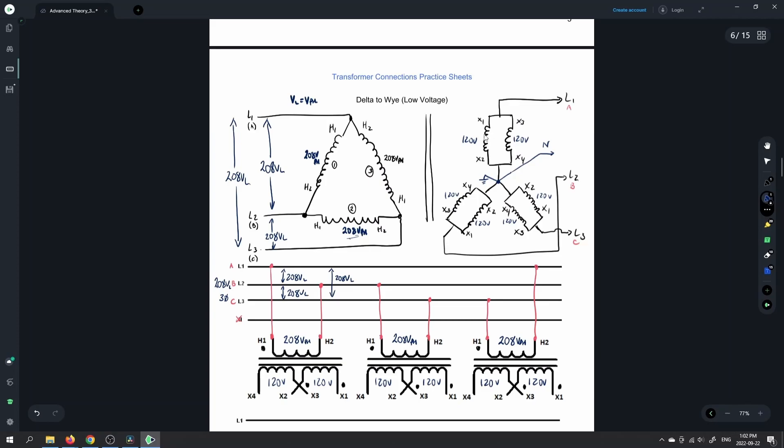And is that our phase or our line voltage? Well, that's inside the circuit, so that is going to be a phase value. Any value that's here on the inside of the transformer is going to be a phase value, so we have 120 volts on the phase. For the delta, V line equals V phase. Whereas for a Y circuit, V line is equal to V phase times root 3. Don't get confused — the ratio from primary to secondary is also root 3, it's 1.73 to 1, but that has nothing to do with three phase. That's to do with the number of turns.